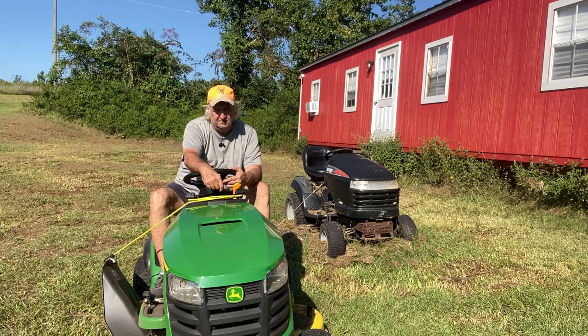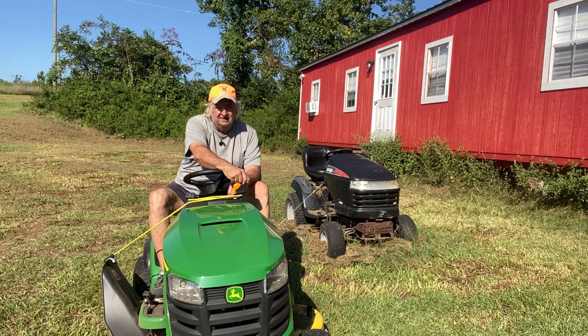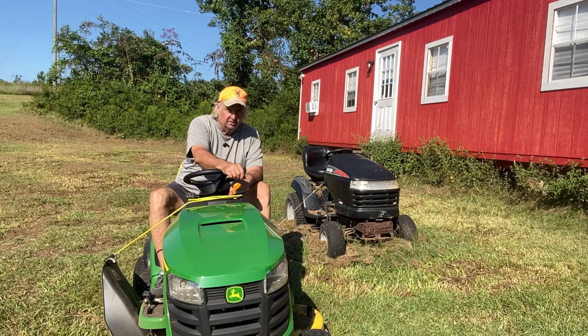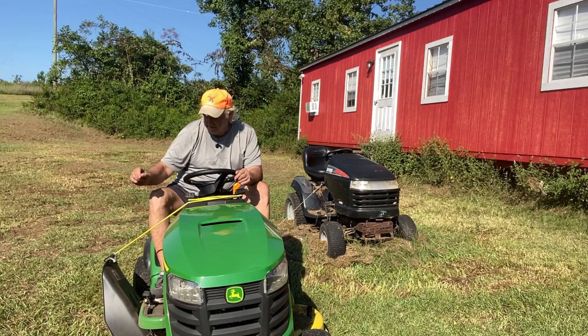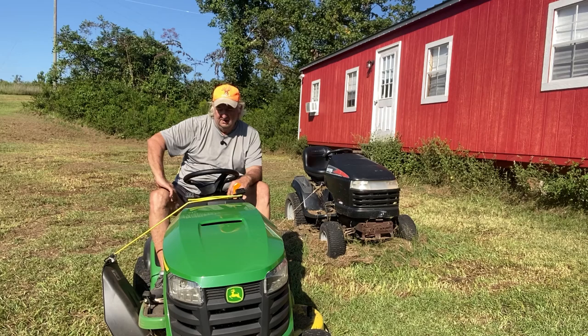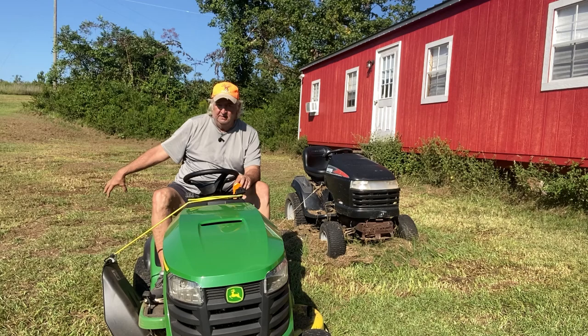They have another one below this — a 110 — but it has a smaller motor, and for as high as the grass gets here, we wanted one with a bigger motor. We really wouldn't want a bigger tractor, but they get expensive quick, so this is what we could afford and it's been fabulous. If you're wondering why I have the discharge guard picked up — we have to get so close to some things, and also when the grass is really tall, if the guard is down it shoots clumps. With it picked up, it sprays out much better.